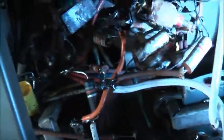Still on, I got some photos of this circuit, this TV posted on the vintage radio and television forums. This is my area here of troubleshooting. So in pin 8 of this valve is where the yellow wire should connect. Well, it goes up a wire up there somewhere, and the yellow wire there. There's another yellow wire there going to there.